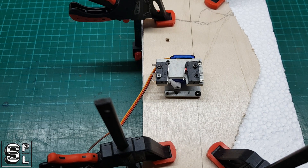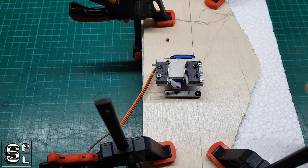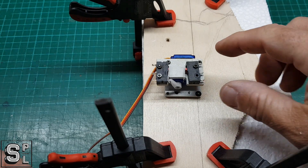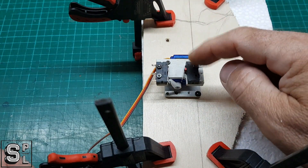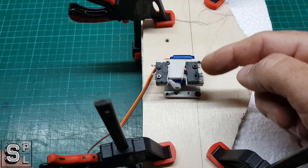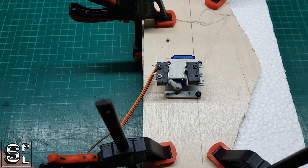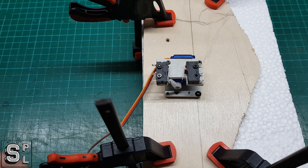This is what I will have at each point. This is a 3D printed servo mount, printed by my friend Franco in the UK — thanks Franco. The two limit switches are going to be used for lights and frog polarity. I'll decide which is which later on. One will be frog polarity — put the positive and negative here, and then this will go to the frog. And we'll have LEDs here for signals and what have you.